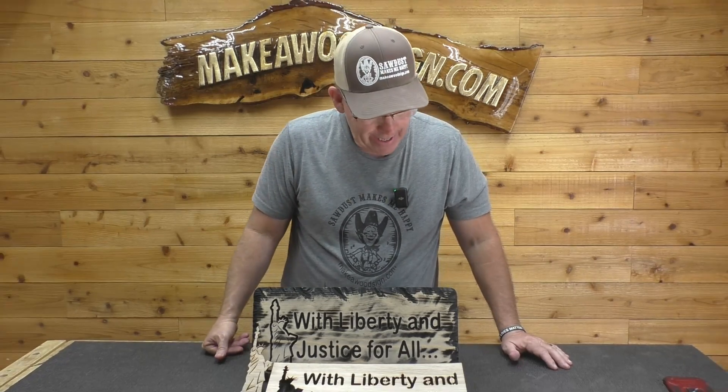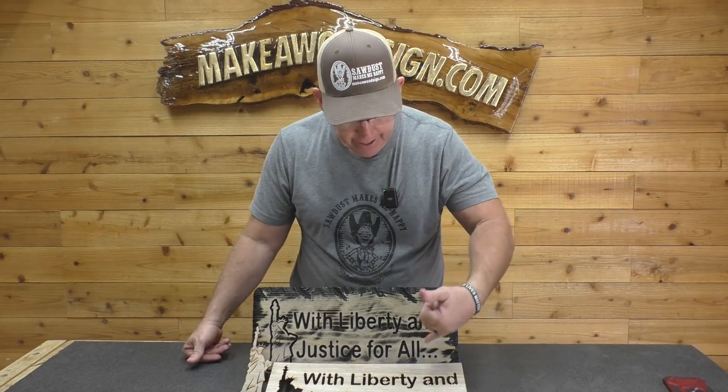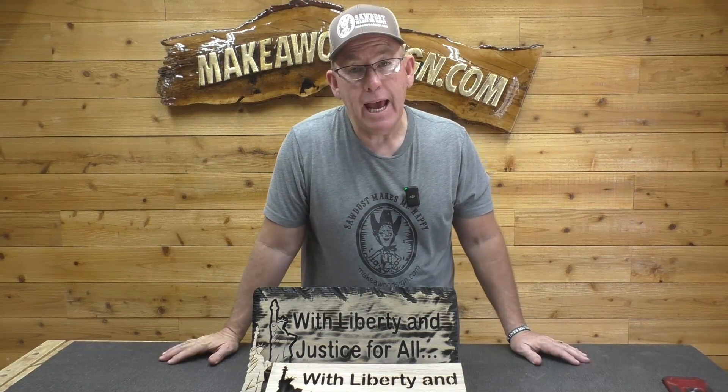This isn't really my kind of forte — it's more rustic, more in Ryan's category. But honestly, I really like the way this thing came out. It's the first time we've used the wire wheel to try to do a rustic edge, and I think it looks pretty cool. We decided to just sand off about half of the black, which gives it a rustic look. It's a pretty simple carve — not super easy, but with a combination of the profile bit, the carving liner, and the 60 degree bit for all the inset letters, it's pretty fast. It was fun. If you have any questions, please email me directly at eric@makeawoodsign.com, or if you want to get ahold of Ryan, it's ryan@makeawoodsign.com. Thank you to all our premium and executive members — we couldn't keep doing what we do without your support. Thanks so much, and we'll see you on the next one.